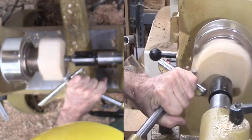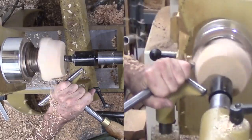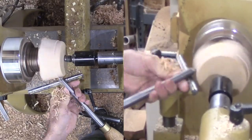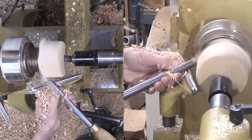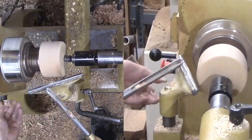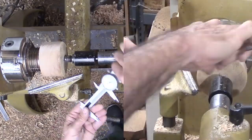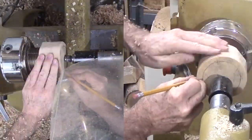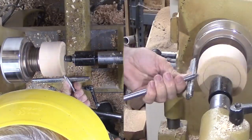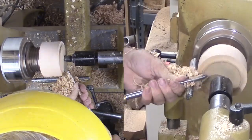I'm starting with the base. This is cross grain, kiln dried maple. I'm pressing the wood against my closed chuck with live center pressure. For now, I only want to round this off. Most importantly, cut a tenon for a proper chuck mount. I'm using my large bowl gouge. By the way, I'm not using dividers anymore to mark a diameter on the wood — I've had too many close calls. Instead, I'm measuring with calipers, making a mark, rotating the mark around the wood, checking to see how close it is.